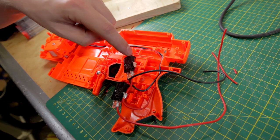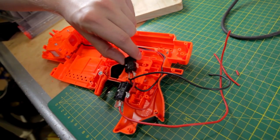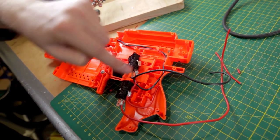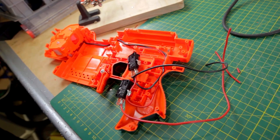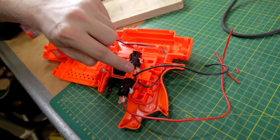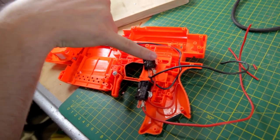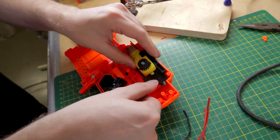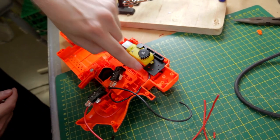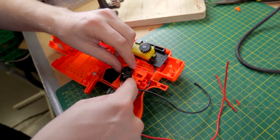And so when we take from this plug and this plug out to the motor, when we click that, this will connect to this, go out to the motor, come back to this tab, and then out to the negative on the battery. And then when we let go of that, that and that will be connected, and there will be no energy input, and so it will motor brake. So by adding the motor in here and here, we've completed our circuit. This thing sits in like this, and it's nice because it holds down those wires. But we need to connect to these two here and here.